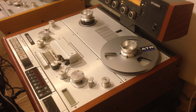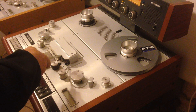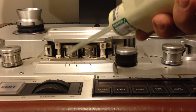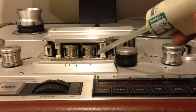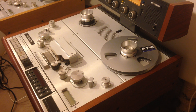The machine must be switched off. Failure to do so will mean the large amount of magnetic flux created by the demagnetiser will overdrive the record, replay and erase amps and could damage them. The demagnetiser should not be switched on or off near any heads, as doing so runs the risk of permanently magnetising the head. Switch the demagnetiser on well away from the machine and, using a circular motion like waving a magic wand, bring the demagnetiser tip up close to but not touching the heads. Keep the demagnetiser moving with small circular motions and move on to the next head until they are all done. When finished, slowly take the demagnetiser away from the heads using the circular motions and switch it off away from the machine.